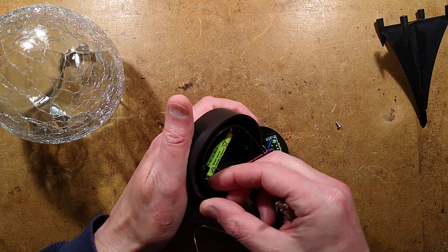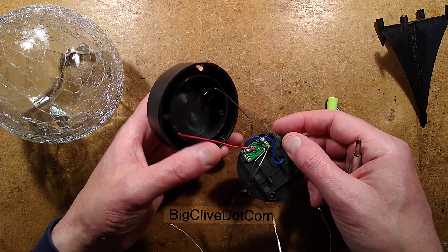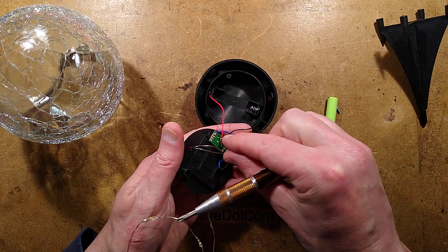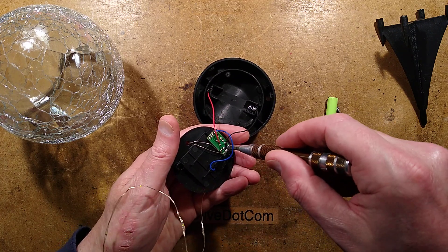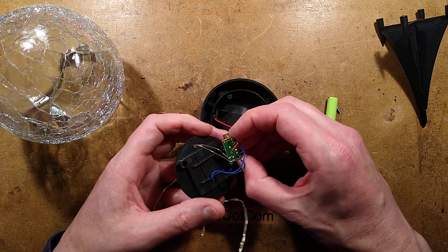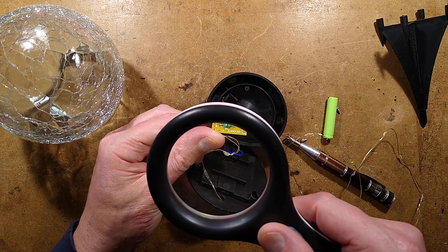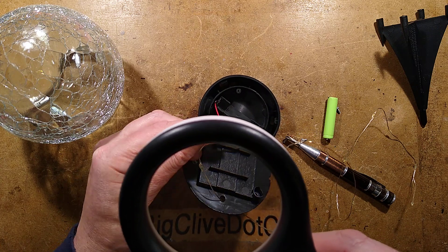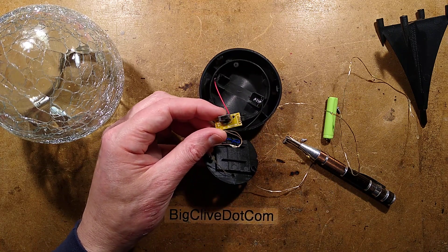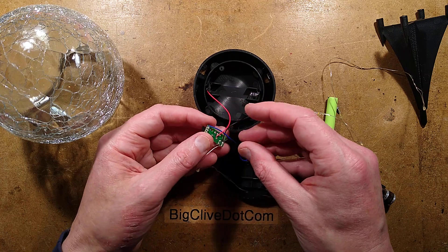We have the classic little circuit board, which I'd guess contains a four-pin chip. There's a AAA cell marked 200 milliampere — that's useful enough. It's nice that it has the little battery holder. One thing to make this resilient: get a soldering iron and bypass the switch completely, because switches are notorious for rusting inside and making a bad connection. It's using an inductor — I think it's 15 microhenries — and the classic four-pin chip to boost the voltage.